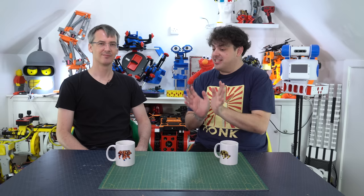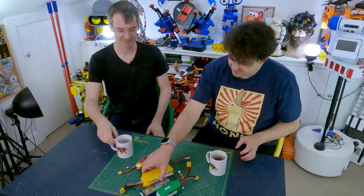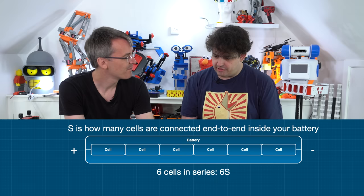Not only are there lots of batteries, they've all got different connectors as well. So this is six 1.2 volt cells, so 7.2 volts, and that would be six S - because six series, that's all it means. It's got six cells in series, like the equivalent of six double A's all in a line together. So that's what the S is.